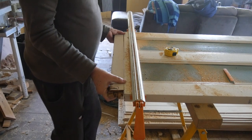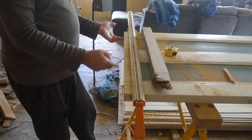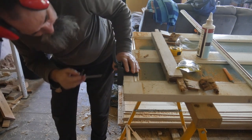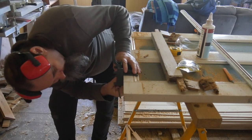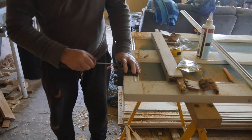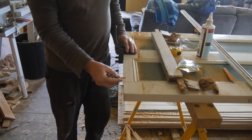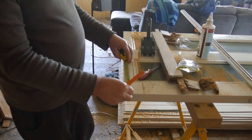That's nice and straight now. We could just glue that straight on but probably best to dowel it — at least three dowels in there, so it'll be a bit stronger. What we've got here is a dowel gauge. I'm going to get that around about in the middle. Adjust the hole so that's in the middle. What this does is there's a hole there — we drill into it so it sets the height on the timber consistently throughout. And when we pop the dowel in we know it'll be right this way, but we still have to measure it from this end.